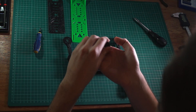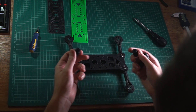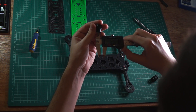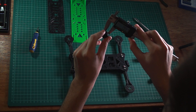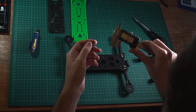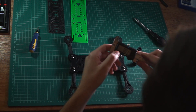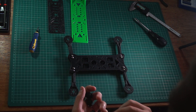This is where usually you'd get some of these, which are vibration dampening balls, and they'd all go in these 7mm holes that are just on the drone. Unfortunately these measure 7mm inner diameter, so I've clearly been sent the wrong ones. The actual hole through the middle of them is 7mm, and the mounting diameter for these ones appears to be around 9mm. So unfortunately I'm going to have to wait and get some new ones, but it shouldn't take too long to arrive. We can get a rough idea if we just add on the weight of — I believe it's 6 of these — and when I do get the new mounting balls I'll re-weigh it and update if anything's different.